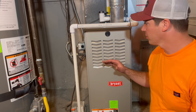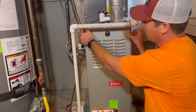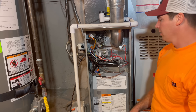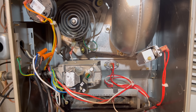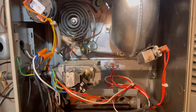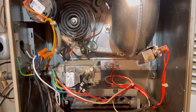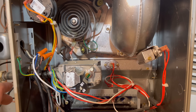I'm going to show you this whole process from start to finish. Currently, my furnace is wired up to the grid — my home power. I'm just going to open this up and show you exactly how everything is working with the power. So we're going to flip that on and you'll notice how the system functions. As you can see, our inducer motor is running, and the next thing you'll notice down here is that glowing hot surface igniter. After a couple seconds, we will have ignition. And you can see we have ignition — this is on our 120-volt power going into our switch. Let's go ahead and turn that off.